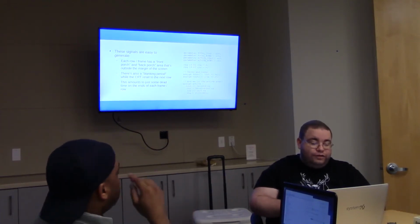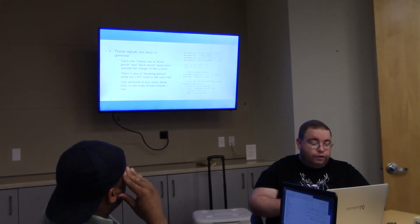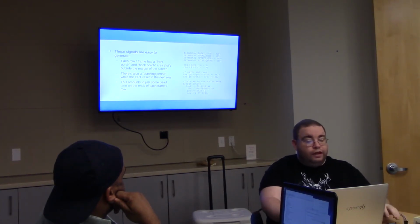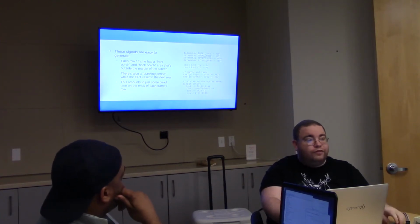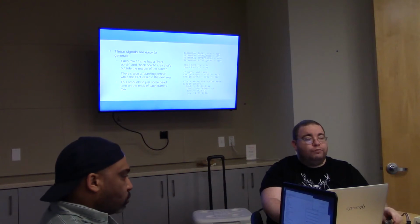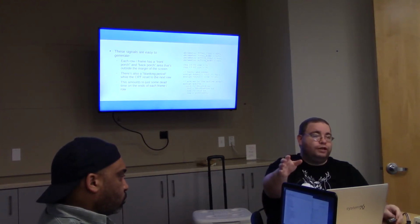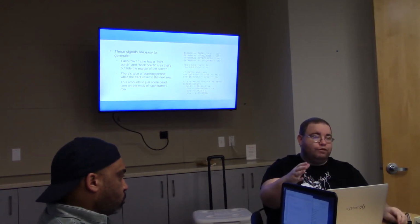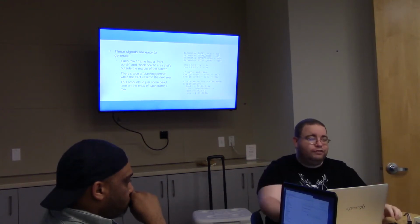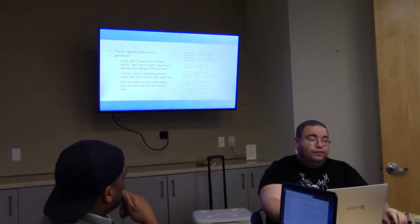The actual screen is 800 by 525 when you count the dead zones. So we're just going to have a total columns and total rows, and then a big, essentially Boolean statement, a bunch of comparisons to those constants, to see if we're in the active area or not. These assign lines are what's called a constant assignment. This is the simplest way to tie things together in an FPGA. What assign does is draw a wire between 2 different nodes of the circuit, so whenever one of them changes, the other changes automatically. It's not like in C where you copy the current value of one variable to another. No, you're connecting these things together electrically. When this thing changes, this does instantly as well, or as close to instantly as the FPGA can make it. So this would generate the H-sync, V-sync and active signals.